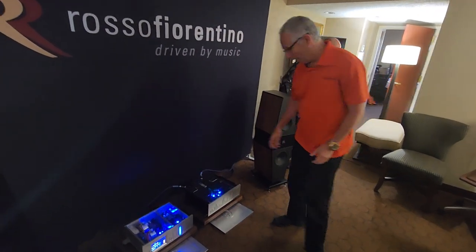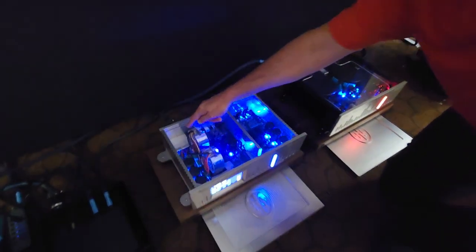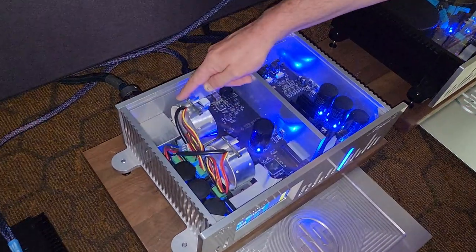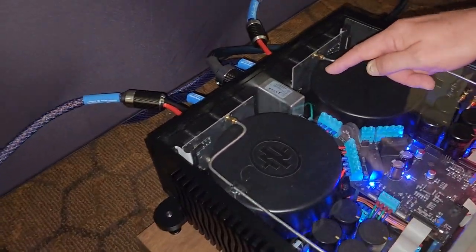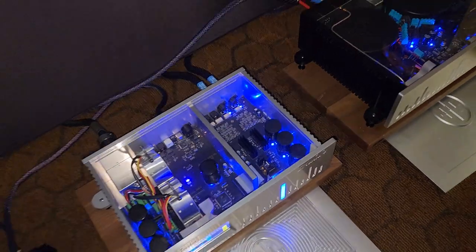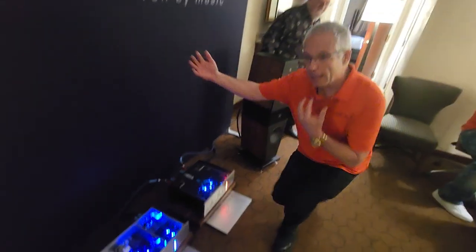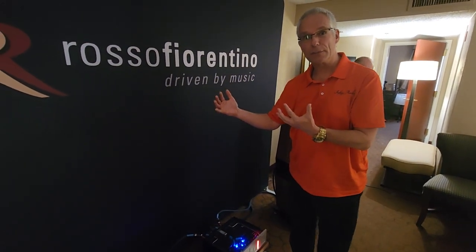What can happen is if you look closer at this equipment, you will see that there's an industrial-grade power filter at the mains entry of our DAC and also at the amplifier. There are coils and capacitors in there. And if you basically draw a very fast pulse through these filters and there's another filter ahead of it, you get an energy exchange between the components in these two filters, and those could actually hurt more than they solve.